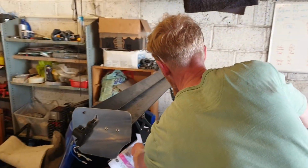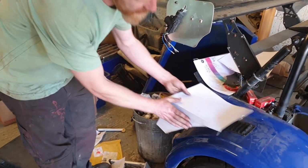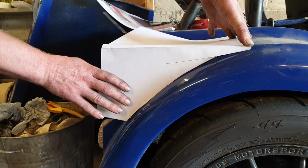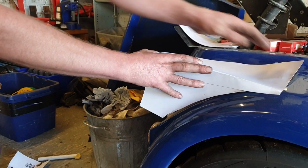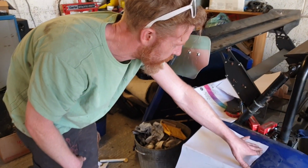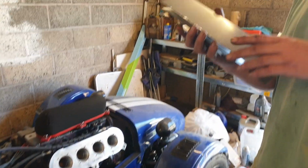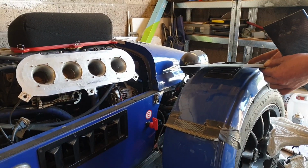We have a cleverer way of doing this. So we will be making pieces that go like this. The difference in those being that this will create a low pressure area back here and actively evacuate the air from the wheel arch rather than just equalising the pressures. Something similar happening on the front, as you can see. Offcuts of fakey jakey carbon fibre ABS. They will go from about here.